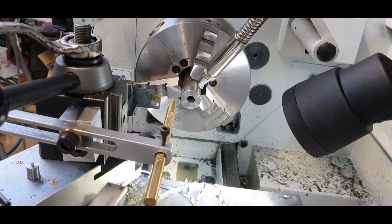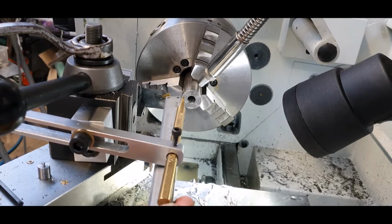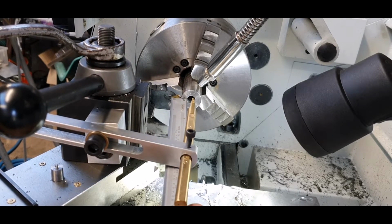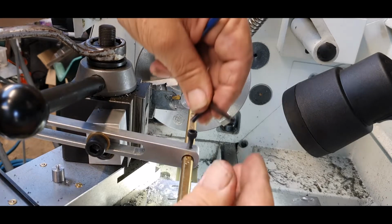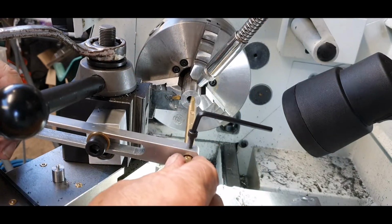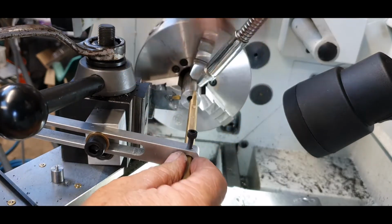So what we're doing now, we're going to set the adjustment here for 7mm, then we can adjust the tool to accommodate. Right, now I've adjusted that one to the 7mm, in other words I've got the cutter there at the moment. So what we do now is we get the actual Allen key and then we adjust the other section of it. Right, so what we do is we loosen this one here. I just hope that's in focus. So we loosen him off and we bring him into here like so. So it's just touching. We lock him back up. So that's locked.